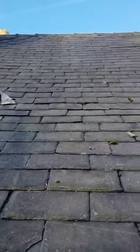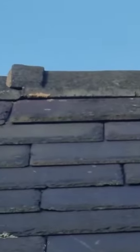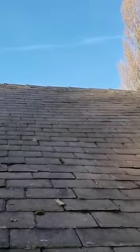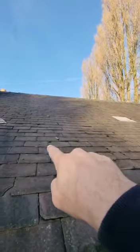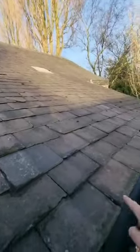Overall it is in reasonable condition. There's a possibility of issues with the ridges — if you can see, we do have some gaps in the ridges where we have mortar missing and no mortar at all. So if water is getting in through the ridges with driving rain or these key areas, what happens is it runs down the felt underneath and finds its way to the gutter.